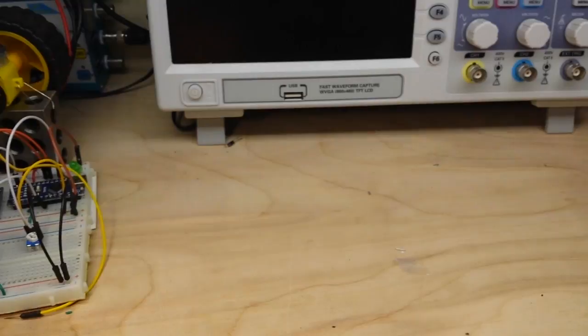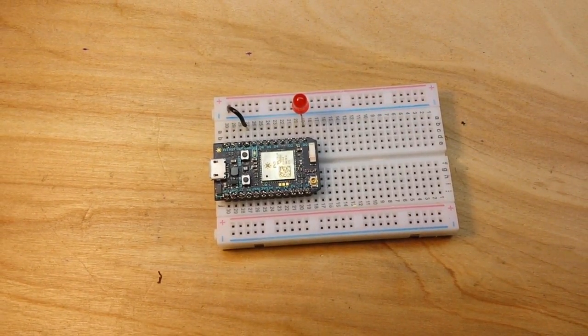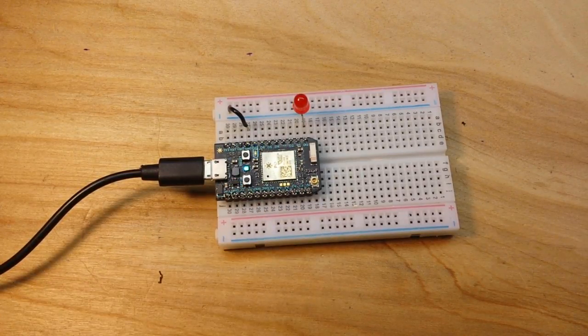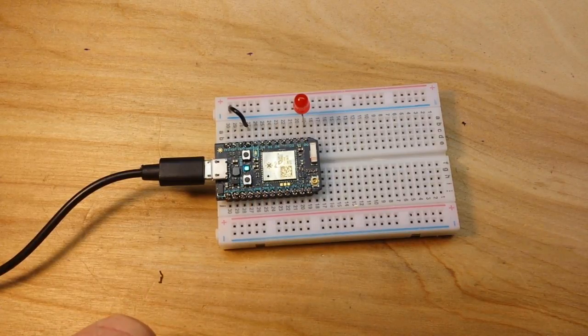I want you to see here — zoom up — see this cable? It's just connected to a USB charger plugged into a power strip. It is not connected to a computer. This thing has yet to be connected to a computer. And we plug her in. The green means it's not connected to the cloud, the cyan means it's connected to the cloud. And we've got our blink! Now, just to show you that I am controlling this, I'm going to change the delay one more time — this time to 100 milliseconds. I'm flashing the code right now. And you can see the lights have changed. And it should be ready here in a second. There you go — we've changed the speed once again.